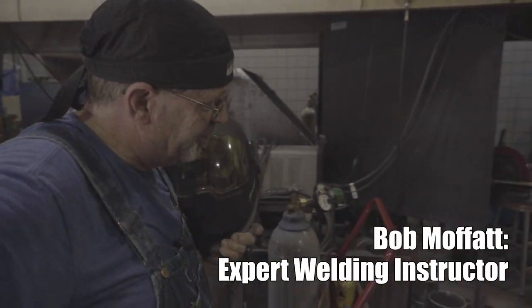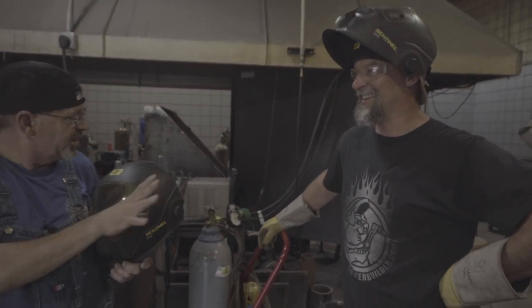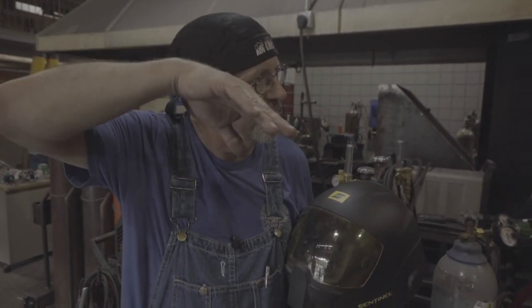Being in the pipe trades, you want to make time and speed, make some money, and do some repeatable processes. Let's say I had 100 flanges and 90s to weld up. I could chuck the flange into the positioner — the rotator — fit the 90 on there, and spin that weld. Spinning means I'm welding a hard wire root with short arc at about 10 o'clock, and the pipe would turn away from me. I could put a flux core fill and cap, and make that weld in 10 minutes or less, drinking coffee in between passes.